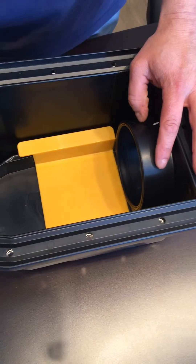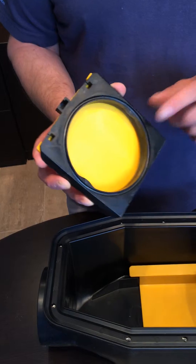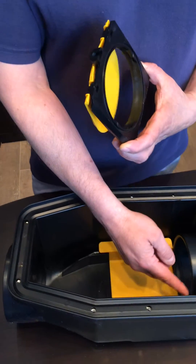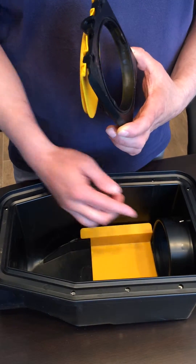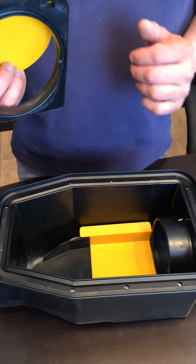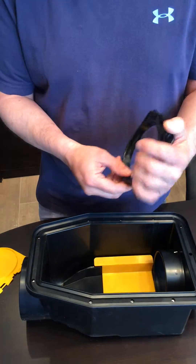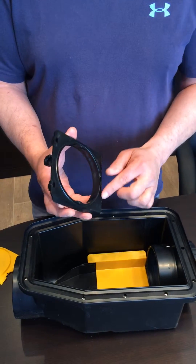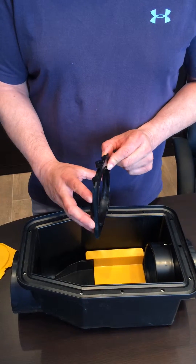Once your valve is clean, we're going to take the cassette. We want to provide some ABS glue — this is ABS — and we're going to put the ABS glue on this rim, just a little bit. You don't need very much. With your cassette, you're going to pop the gate off. The cassette has its own O-ring in the front; it does not have an O-ring in the back, although there is a provision for it. We don't have it on this one because we don't need it.